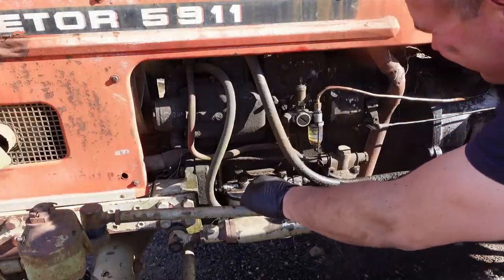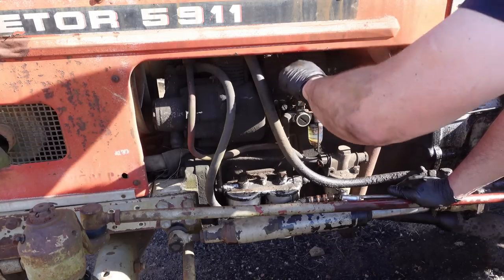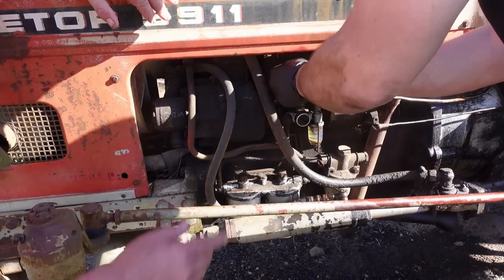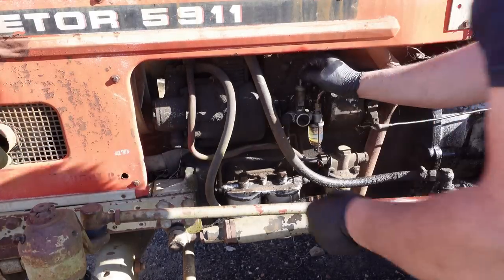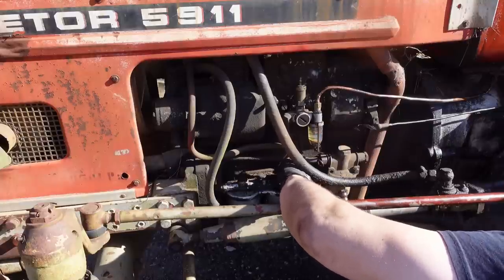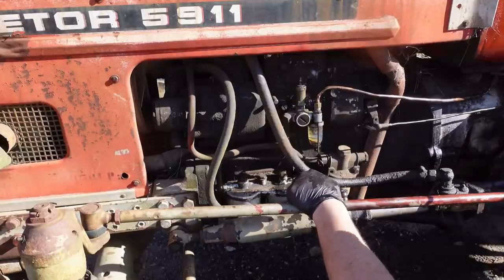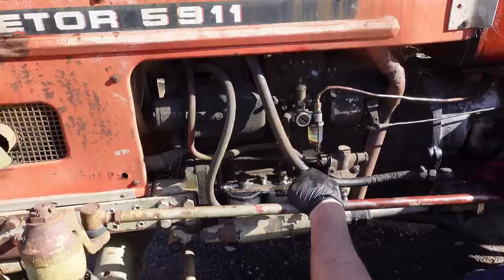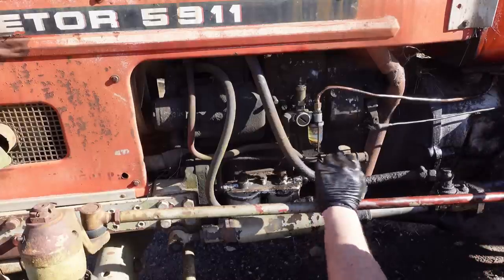Secondary one was alright. I have to wind her over, just bar her out there and get the pipes, mate. Hey? I'll crack it and let the air out of it. What's that one for, any handy? The oil? It's for oil. Injectors. Once you get the pipe clean to the injectors, they should clear themselves straight away. Yeah. Wouldn't they?